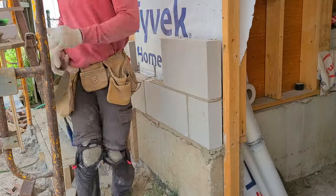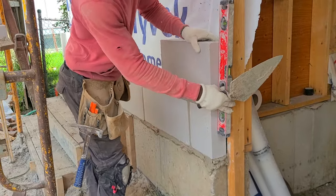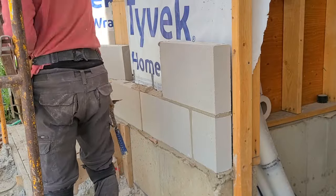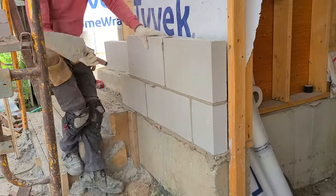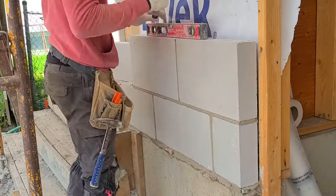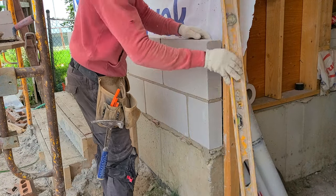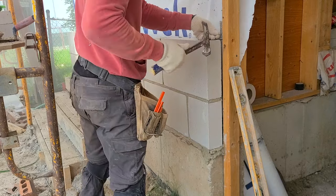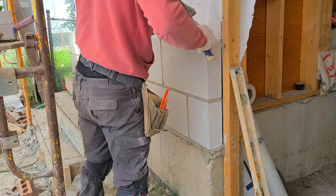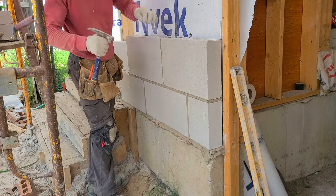Right beside our garage door here, I put a template just so that way I can maintain the straightness of the stone here. You always want to step away around 1/8 to 1/4 inches away from where your garage door is going to be, just for caulking space, and if they ever replace the garage door in the future, it won't encounter the stone. It'd be pretty simple and straightforward to remove the garage door without damaging your stone.